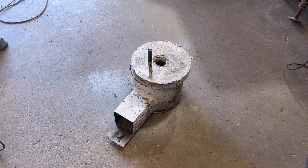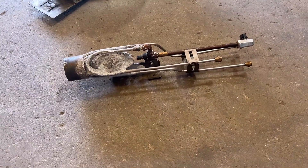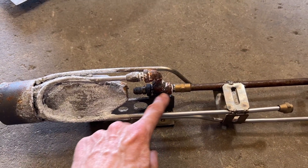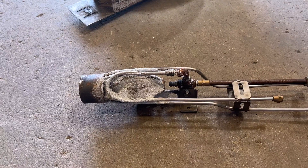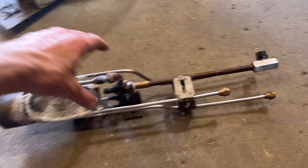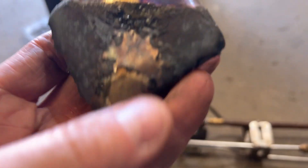We're gonna be running this thing on a furnace today and our goal is to melt some drill bits. If we can melt some drill bits, we've achieved a temperature that's beyond the reach of your typical air aspirated combustors. Normally to melt drill bits we would need this bad boy right here — this is called the rocket burner. It does have the air preheat line. This thing gets red hot and it results in this thing ending up about 350-some degrees. Typically to melt drill bits we would have to inject oxygen into these two oxygen lances.